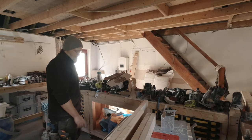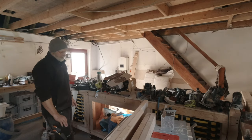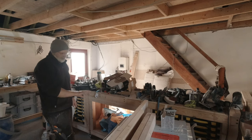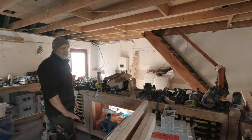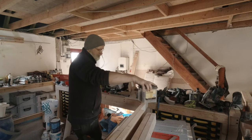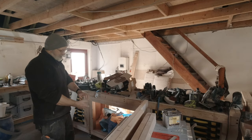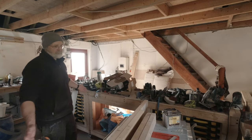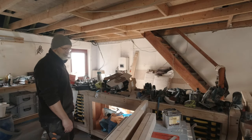The height in the front here is 61.5 centimeters, and I'm going to put in six drawer slides. At the bottom there will be one that's 18 centimeters, on top of that two 12 centimeter ones, and on top of those three 6 centimeter ones. So anything like these big heavy screw tubs can sit in the bottom drawer, anything a little taller in the two in the middle, and anything really quite flat like sandpaper or speed squares can sit in those flat drawers at the top.